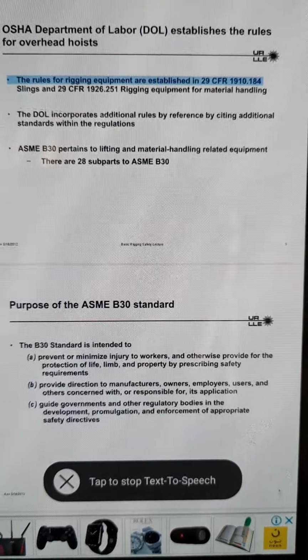Basic Rigging Safety Lecture 12. Rated versus non-rated rigging hardware. The terms rated and non-rated have specific meaning in the rigging field. Load-rated products are engineered with special considerations important to lifting loads with cranes and hoists. Non-rated products often look the same, but their engineering does not provide the same design factors and safety features as the load-rated versions. Never use non-rated products for rigging.